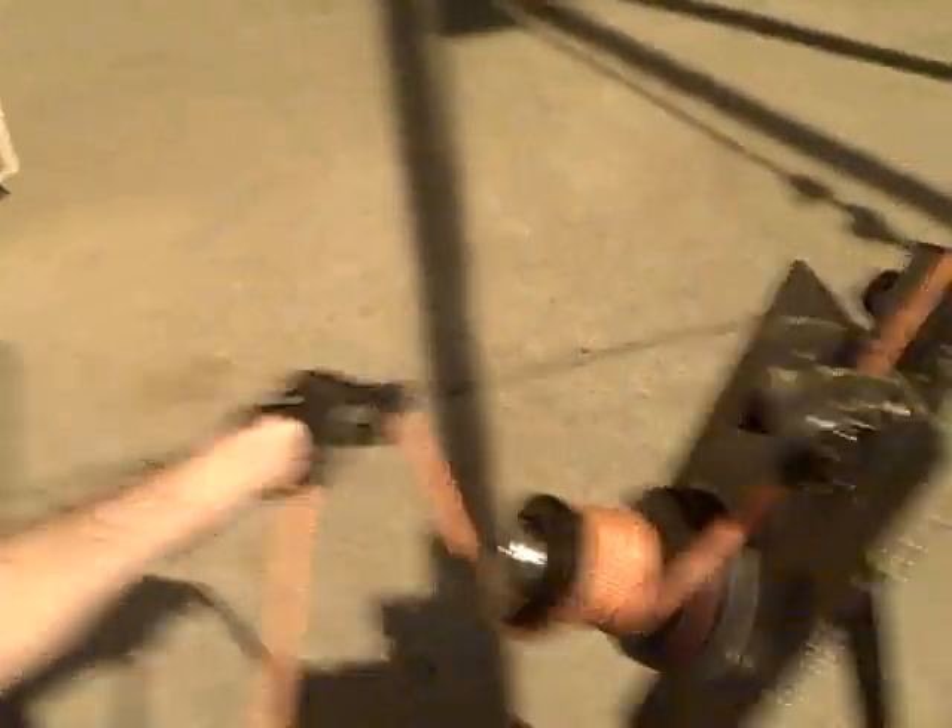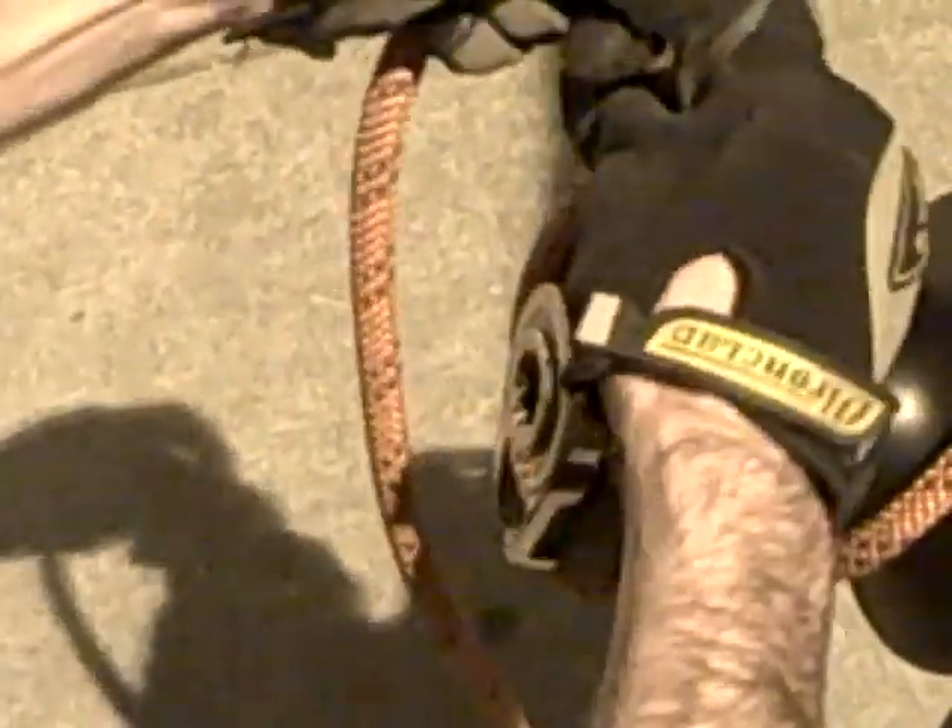When you want to store the pulley, it's on this side — you just stow the pulley in the side so you don't lose it; it just fits right in there. When he wants to lower, he unlocks it from the top and the drum. With mechanical advantage it just slows right down — that's his friction brake, round turn. You can see it's just lowering. When he wants to change directions, he rewraps the drum and pulls that lever out.